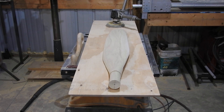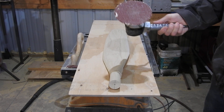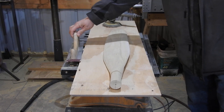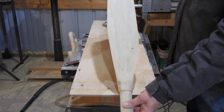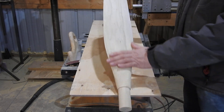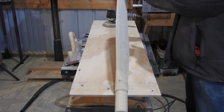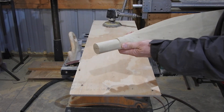I've finished doing the rough sanding of the prop. I used a DA sander with 36 grit and a little straight sander again with some 36 grit, and this is where we're at. I've got the thing cut off and trimmed down. That's just the rough sanding. Now it's going to take some fine sanding to trim it out, get both edges nice and clean.